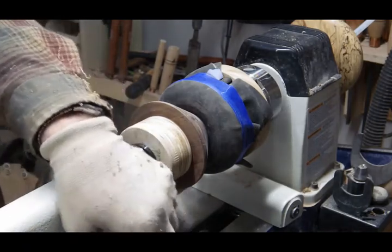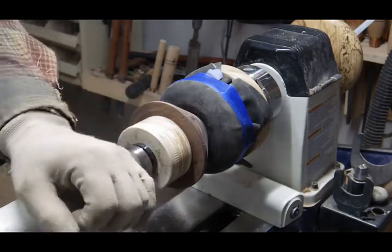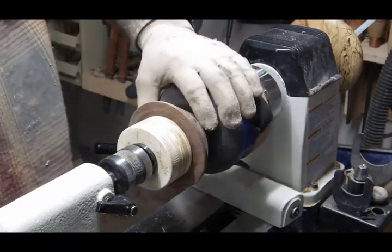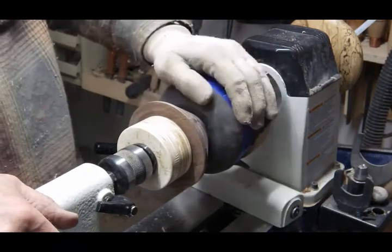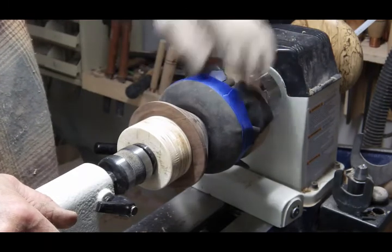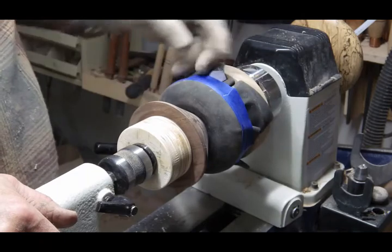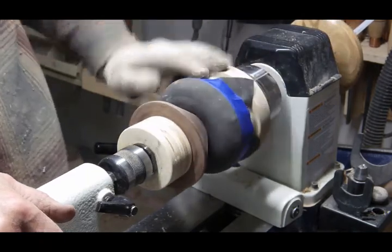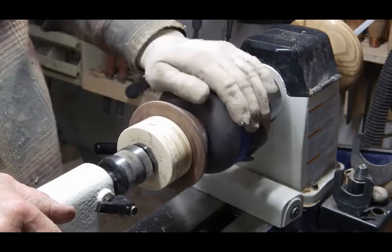That'll just help hold that in till it totally sets up. Like I said, leave it set, let the glue dry. You can come back, pull the tape off, trim all this funky leftover, and you will have a working vacuum chuck.